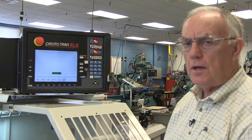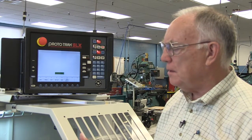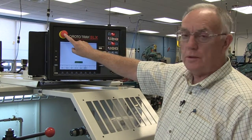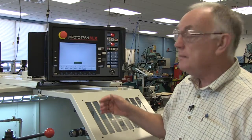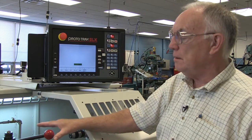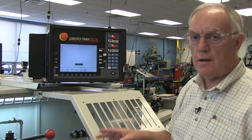There's a difference between shutting this machine down at the end of the day and shutting it down in an emergency situation. If something goes wrong with a spindle, where the part comes out of the chuck, or something doesn't look quite right — you're traveling in the wrong direction — you can always shut it off with that big red button. Don't think you have to go through this long procedure in an emergency. You just hit that big red button and it stops the motion of the spindle and all the axes of the machine. What we're going to do today is show you how to shut it down at the end of the day.